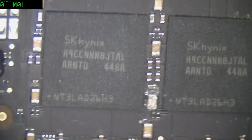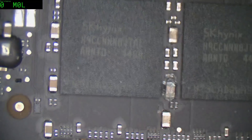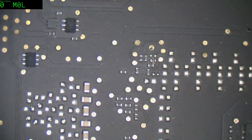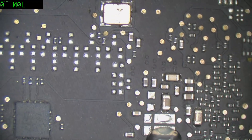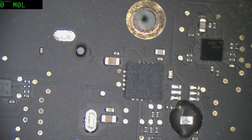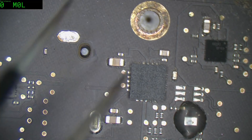Very interesting — that's going to be fun getting that in and out. Fortunately these RAM chips are not underfilled, so it's not a problem at all. Just have plenty of flux. So those are our two main faults. I'm just going to keep looking around, because if there's two, what's to say there isn't three? This is definitely going to be an ultrasonic one — there are areas of slightly questionable stuff.